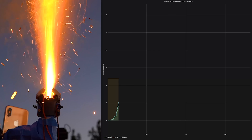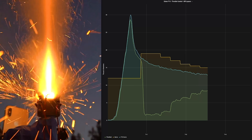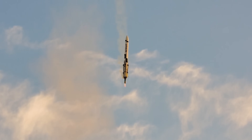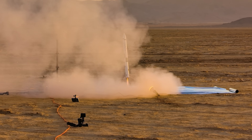Because this is a solid rocket motor with a fixed burn time, we're also working with the constraint that at some point this motor is going to shut off, and we want to be really close to the ground when that happens. We can close the throttle arms all the way to try and cut off as much thrust as possible, but we can never quite cut it all off — we're still going to have maybe 20% thrust when it's fully closed. So the way we do this is we measure when the peak thrust of the landing motor occurs and start generating our set points based off of that time and altitude. The issue with this approach is obvious given the flight you just saw: if we reach an apogee that is much lower or higher than expected, those set points based off a 25-meter drop don't give us the throttle range to get back to that curve as we come in for the landing burn.